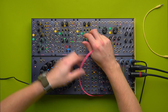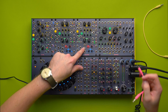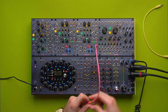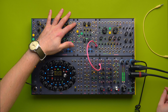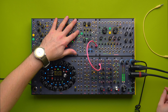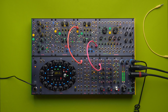If you remember, we can scale the green generator to a fast time scale and use it as an oscillator. Combining this feature with the internal semi-normalization means that we are running an oscillator through a voltage controlled attenuverter. If I patch this output, the yellow LFO will control the green generator's amplitude. I can even use it as an envelope, so with a stream of gates triggering my yellow envelope, I can use this as a sort of VCA.